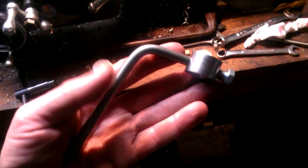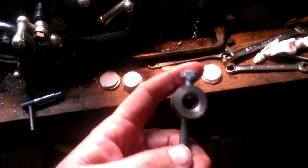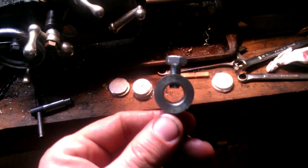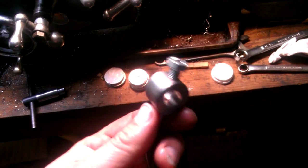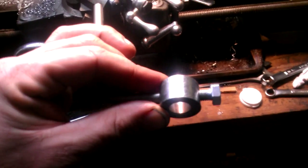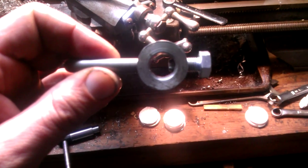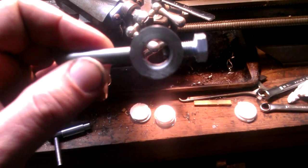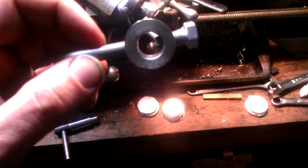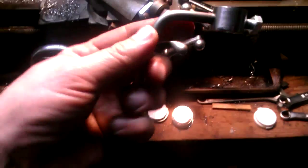Being too cheap to buy a lathe dog, I just scrounged up a little bit of scrap. I'm going to bore a hole through here — that's a half-inch bore. Then I mounted it into my four-jawed chuck and drilled the root diameter for a 5/16-24 clear on through. That gave me really good alignment when I put this rod in the other side. It's threaded and stuck in there with some Loctite, and then just bent her over.